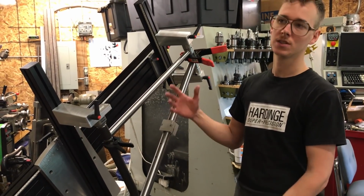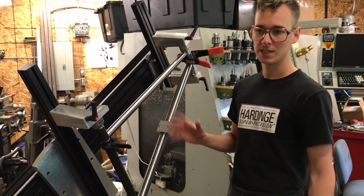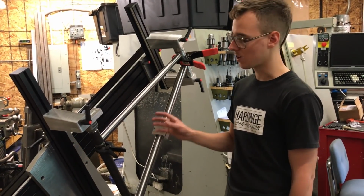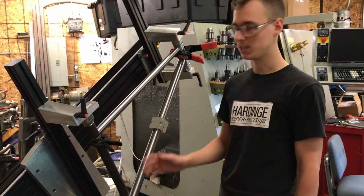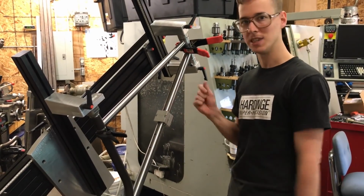So, thousands and maybe hundreds of thousands or probably millions of steel bikes get TIG welded without back purge, and it's generally fine if you get a good weld in the first place. So I'm not going to worry too much about it, but it is better. If I had more gas in my bottle and I wasn't at risk of running out today, I would maybe go through the hassle of back purging this frame. So yeah, I just need to drill these holes and do the final prep to make sure everything's clean, load it back in, and then we can tack it up.